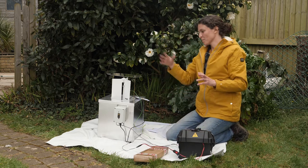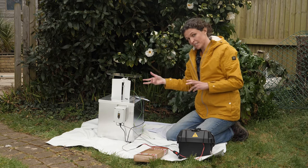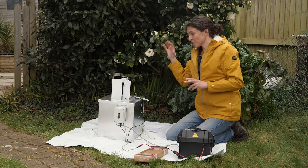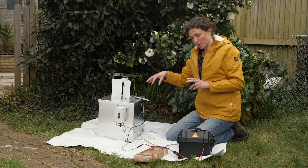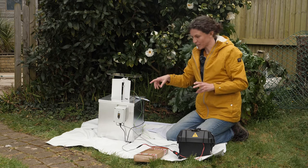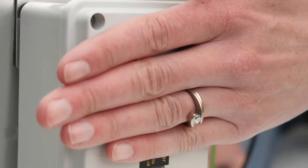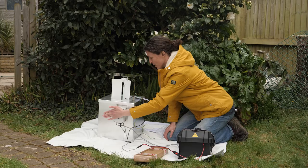Now, the moth trap, at the center of it is this light bulb, and that's going to light up at night, at dusk, and attract any moths into the trap. You might have noticed that the light hasn't come on when I've plugged that in, and that's because of that sensor that I mentioned. So when I cover the sensor over, you'll notice that the light comes on, and when I uncover it, it goes off.